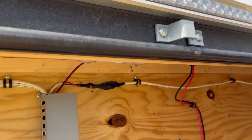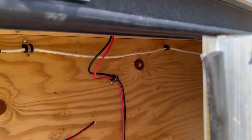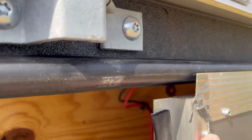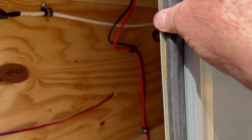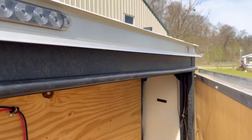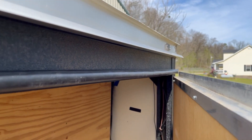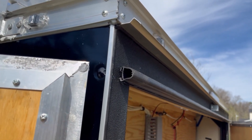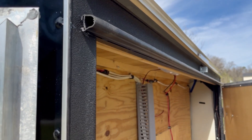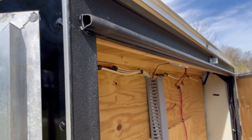Attaching it and sliding this seal on went well. I just put some lithium grease on the track before I started sliding this rubber piece on. And this piece is eight foot long, but I got it on by myself just fine — just had to move back and forth. You can see the edge of the door is only coming halfway up on this seal, and at the bottom of the door open it's got about maybe a quarter inch overlap. You can see the size of the gap between the bottom of my seal and the top of the door trim. So when I put this track on underneath, I stuck it up with the self-adhesive tape and then put three screws on each side — self-tapping metal screws — just to help hold it in place. The doors are going to be closed 90% of the time so it's not going to go anywhere.